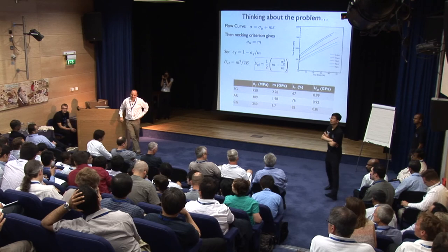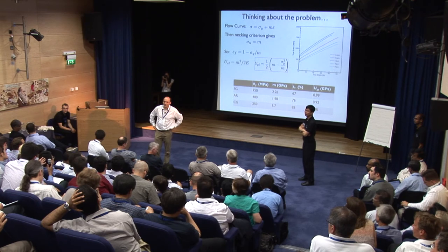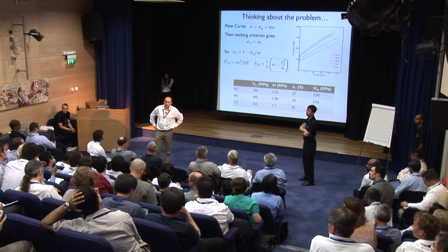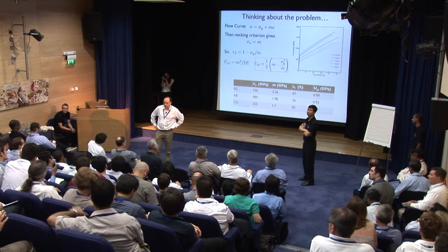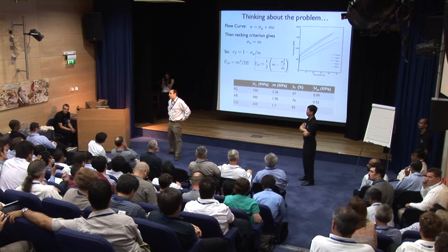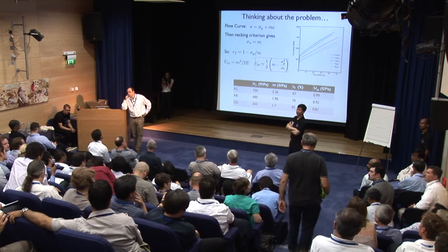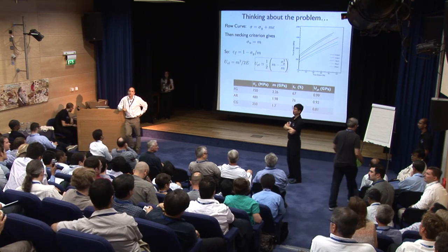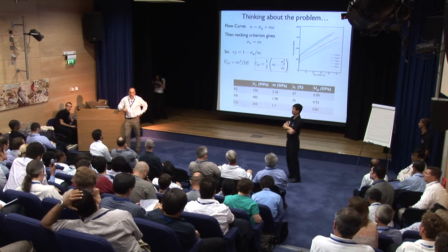Rashid: Thank you. I guess you're trying to meet two objectives in one material. As you said in the beginning, as a projectile is coming in, you want a harder face to blunt it, and then you want material to absorb the energy. Is there any way you can tailor the microstructure very carefully so that you can get a harder face? In making it harder, you could. You could try carburizing, case hardening sort of approaches, and they will be quite effective if you want to.